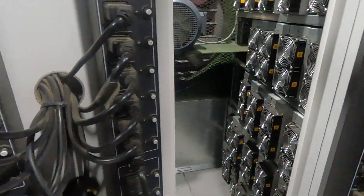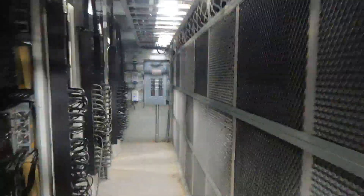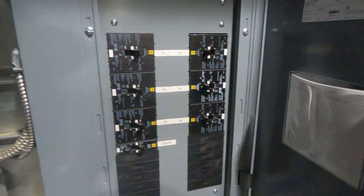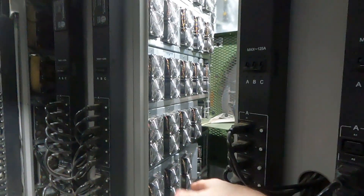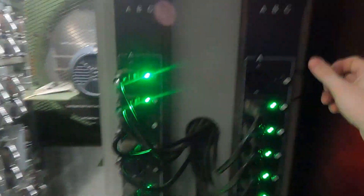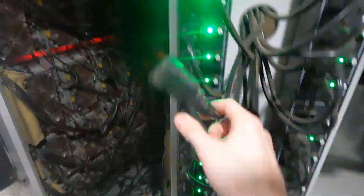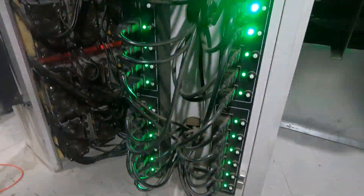In the second container up top there are fewer miners — that's going to be where my personal ASIC miners are located, and I'll be able to show you those. All the miners in this farm are Bitmain, but the ASIC miners I have personally are GoldShell. I'll go ahead and fire these back up. I've also noticed I get better results with the container door off — maybe it lets the hot air expand and come out. We're firing all the rigs back up and making sure all default breakers are on.